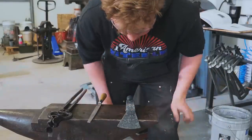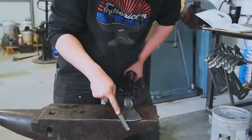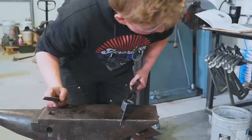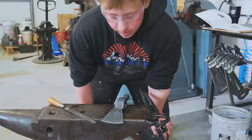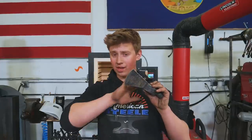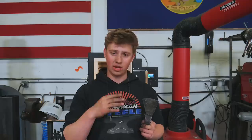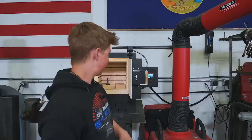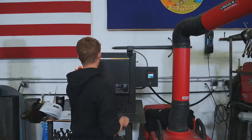So it's cooled down a bit. What we're going to do is make sure that it actually hardened. I'm going to wait for that kiln to cool down all the way. I'm going to go ahead and grind off a little bit of the blade so we can see the temper colors and stuff like that. Now that I've got a little bit of the blade cleaned off, I'm going to throw it back into the kiln and temper it — two cycles at 425 degrees each, letting it cool down to room temperature in between. Back in here, set a quick tempering program. We'll just let it hang out in there for a bit.